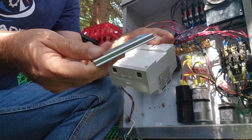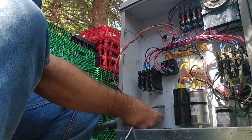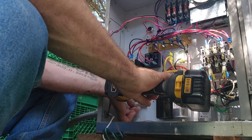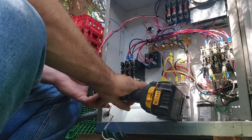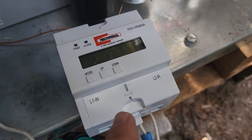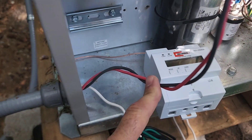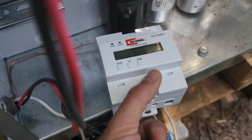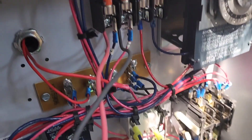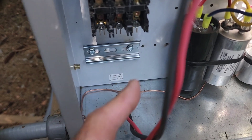To get the DIN rail out for mounting purposes, we just pop up this latch and slide the DIN rail out, and mount it where we need it — right there, just like so. At the bottom we have our line one and two in, and at the top line one and two out. All we have to do is cut the wire at the appropriate spot, wire it in, and then wire the piece going up to the terminal block out the top. We'll wire it outside the cabinet since there isn't enough room once it's mounted.